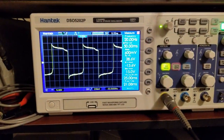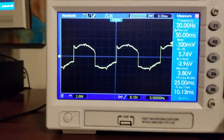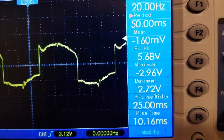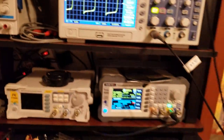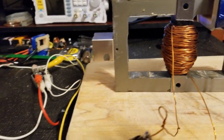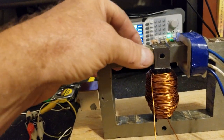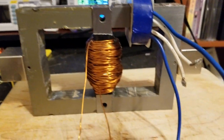So we got 33 to 330 milliamps — 810, 820, whatever you want to call it. This scope is sampling the input right here on the drive on the tickler coil, and this scope here is the output. That's what we got — peak to peak almost 6 volts. Obviously I need to put coils on all four corners for a real test. I might just wrap this with Gorilla tape and put some wire on there to see what I've got before I get too fancy. This is 20 Hertz.